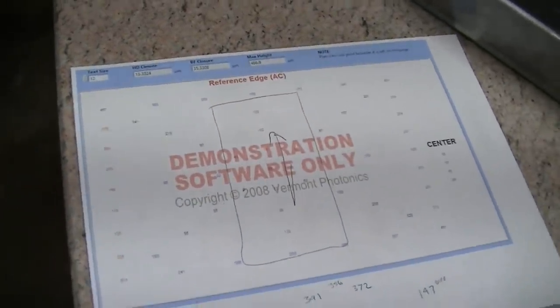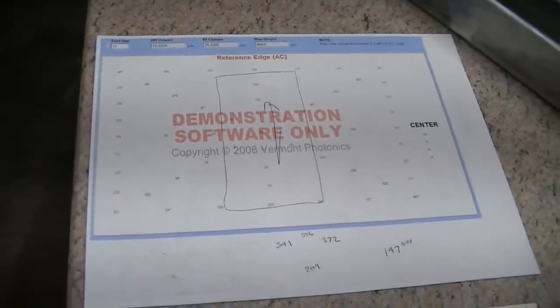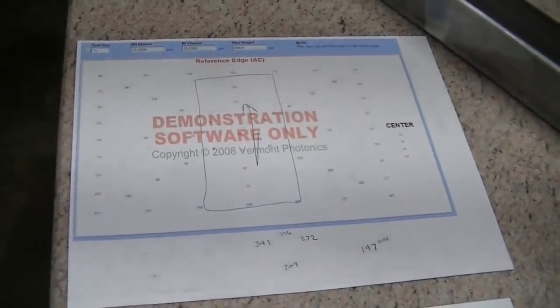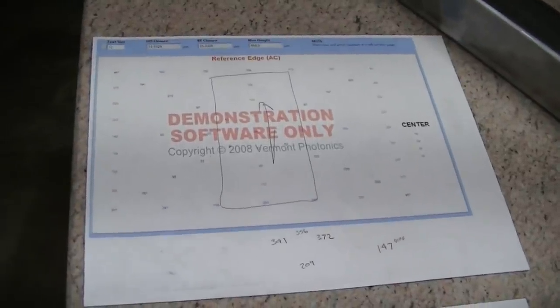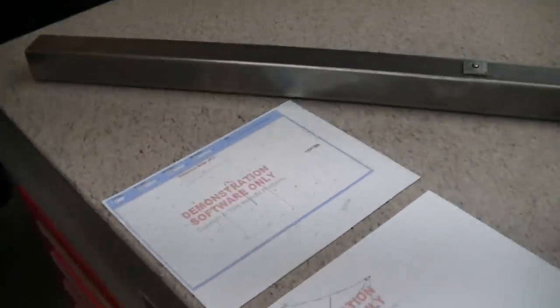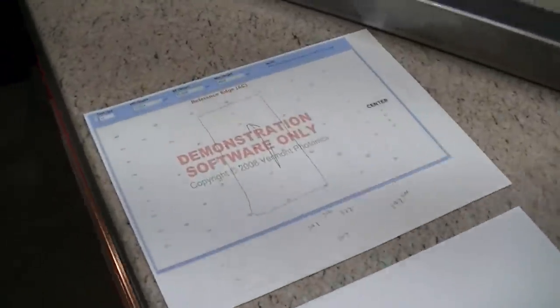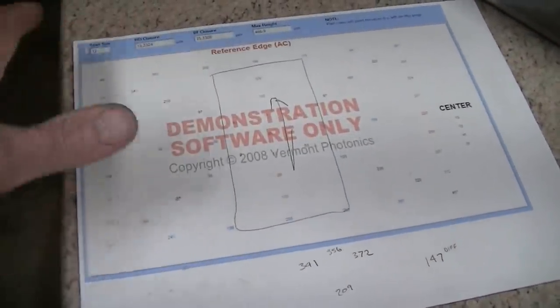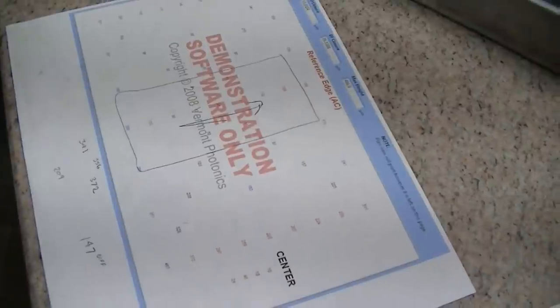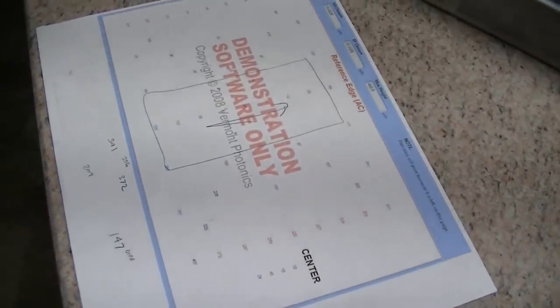And it's very important to make sure that you're making corrections in the right direction. I've seen lapping people take a plate so far off from reading things wrong that they had to take the plate away and have it resurfaced at a factory. So really important to make sure you know what you're doing. Double check. I just double checked again with the 2-footed twist gauge, which doesn't lie. And I had forgotten this orientation thing. So if I would have just followed this paper, I would have had it this way, and I would have been aggravating the twist that was there, making it worse. So that's a prime example of really, really, really be sure you know what you're doing. And even then you make mistakes, so be careful.